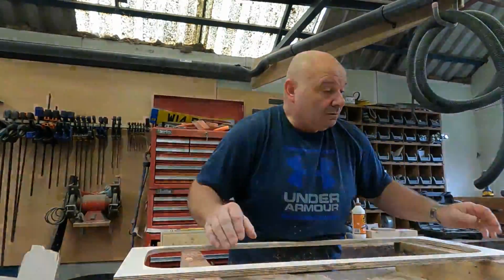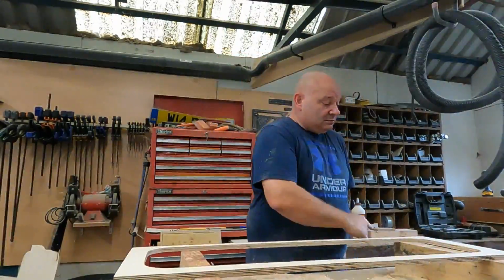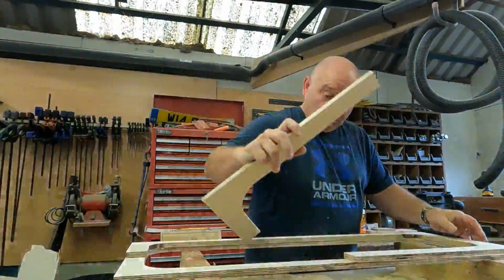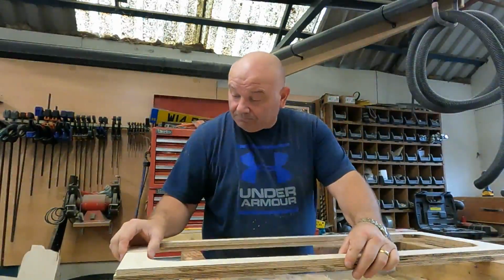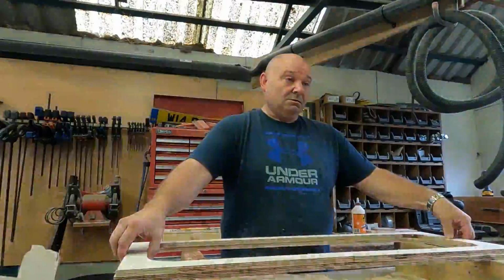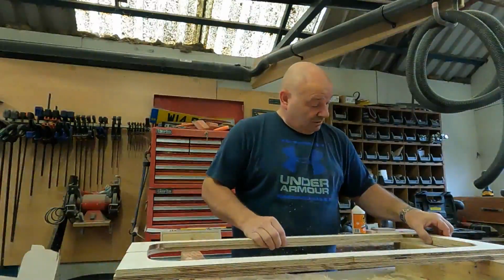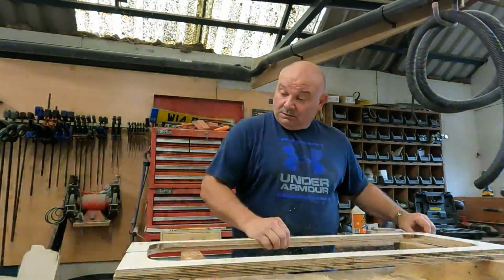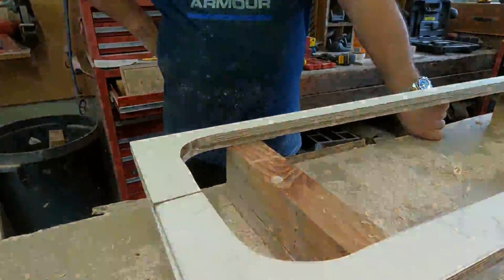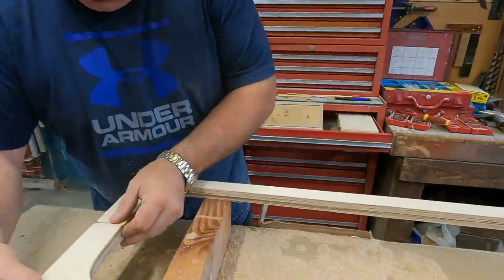Well, we can laminate up now using the same thickness bit of timber, making sure that the joints are nice and flush, and alternate the joints. This is the first laminate for this window. Okay, so why don't we cut just multiple pieces of these then and keep adding these? Because it's a waste of timber, really, complete waste of timber. So we've got offcuts from previous jobs we did, and we're just using that, overlapping the joints every time we laminate up. So it's going to be gluing, tacking them in, letting them dry, sort these joints out so they're nice and neat.